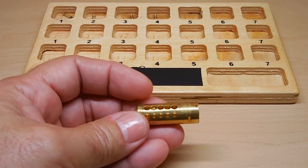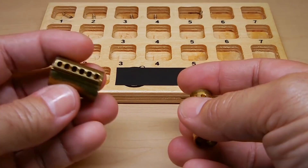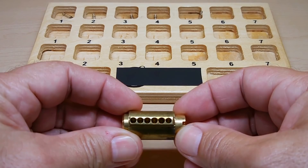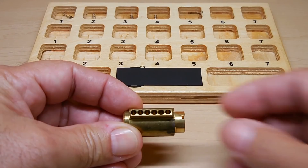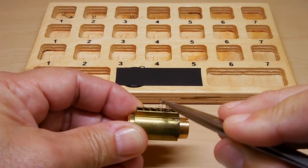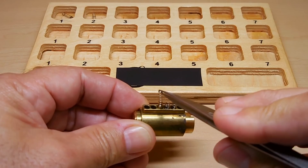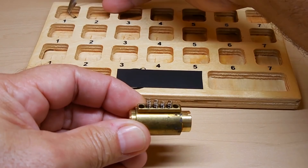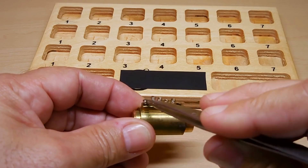Now I'm going to put the plug back inside of here. Everything's lined up perfect and I'm going to angle it — everything is lined up pretty good. Let's take number five, drop it in. Let's take number four — put that one in. Three — they're all lined up. Two. And one. So they're all in, and you can see the varying heights of the springs because the lower pins are varying sizes from small to large.